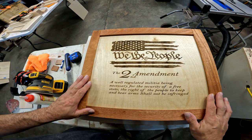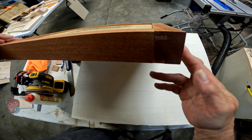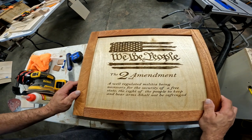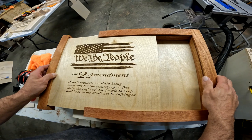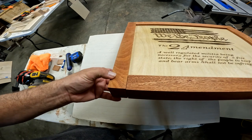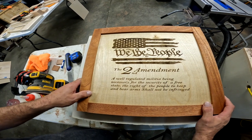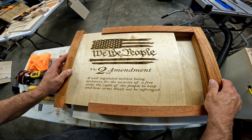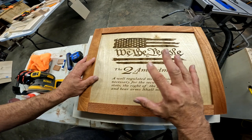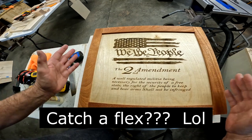So that's the end result. Hopefully I didn't bore you to death and hopefully you learned a little bit. Hopefully someone will tell me how to fix those little notches on the end. They turned out pretty good — you can't tell it's not supposed to be there, but it did take me an extra 30 minutes just to fix those two little holes, which would have knocked off the time of the project. The panel opens and closes perfectly fine. I shaved this other side down a little bit just so it wouldn't hit the wall — that's optional to you. I'll probably be showing that off or doing other videos on it, so that'll keep you from hitting the wall when you open and close it. Just make sure you use a good piece of plywood — don't use anything super cheap like Luan that's going to flex or bow. Because if you open this up or leave it off for a while, it may actually catch a flex and when you go to shut it, it's not going to shut properly.